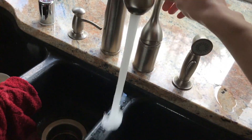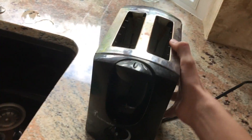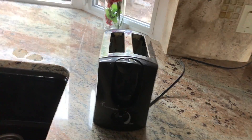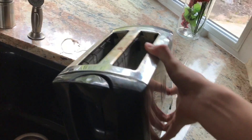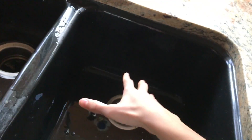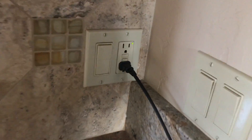So here's a sink, and it's on. It's early on a Saturday morning and you just got up and you want to make some toast, so you get your toaster out, go ahead and plug it in, find some bread, put it in and start the toaster. And then you get distracted, but you want to go and check on your toast, so you come over but accidentally knock the toaster into the sink. And remember, our sink is still on. So you go to pick it up, and boom — at that point right there, you would be electrocuted if this weren't a GFCI.